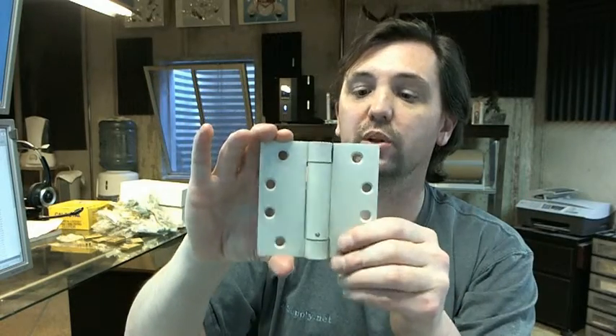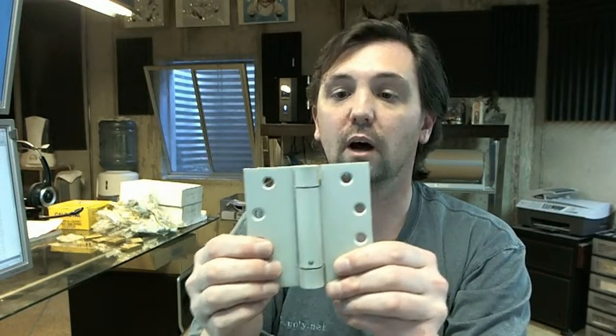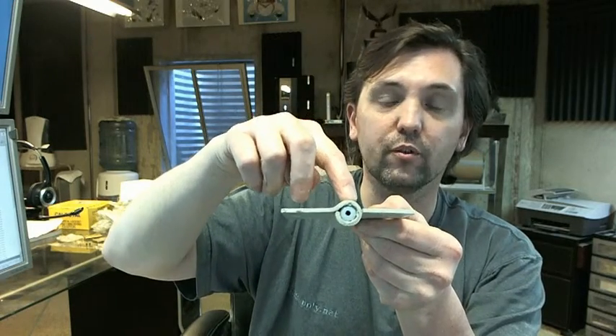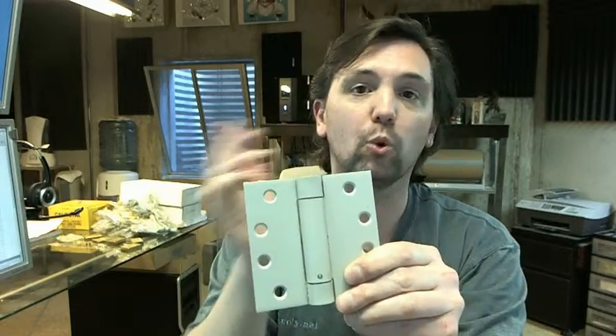For 85 pounds they recommend 2 hinges, and up to 110 pounds would be 3 hinges. I'm a fan of using all spring hinges only, from the perspective that if you over-crank or over-set the torsion on the spring and it snaps, the hinge is not serviceable — it has to be replaced. So maybe opt towards a more conservative number of hinges based on the door weight.